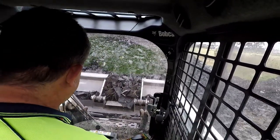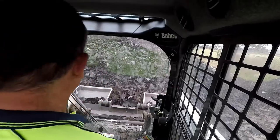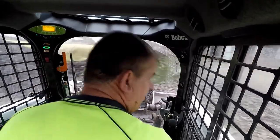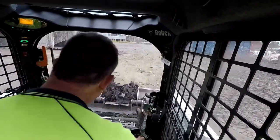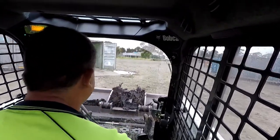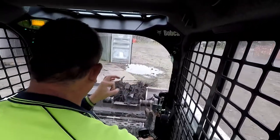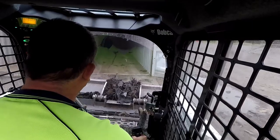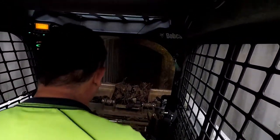You get some large pieces and some small pieces, but that's what the super chopper does. The rasper breaks it down to even much smaller sizes. Then we have two granulators that follow the rasper, and they turn the little chips — something like that — into a 2 to 3 mm granule. The next one takes it down even further to maybe a 1 mm granule, and then the last machine, which is the cracker, actually turns it into a powder.